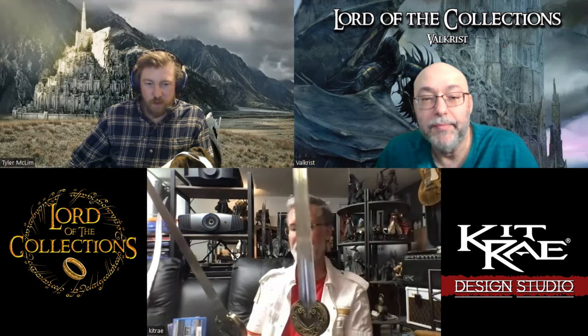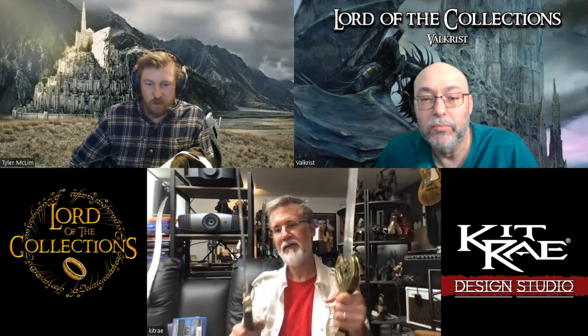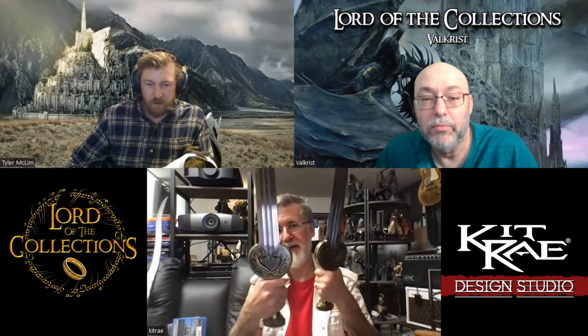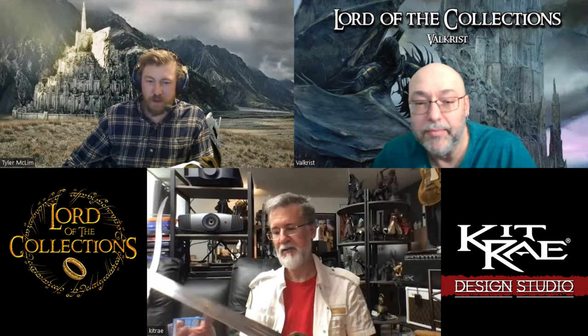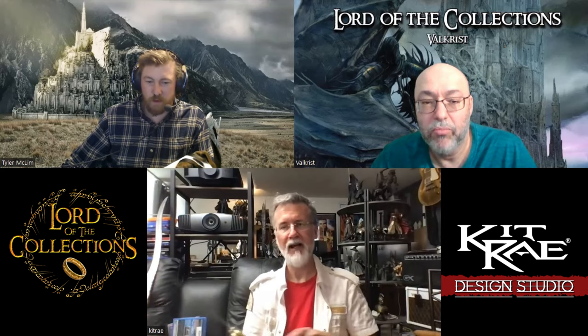What would you say the weight difference is between those two blades? I did a lot of work trying to get the weight down on this. You would think this would be heavier being real brass. This is heavier. This actually is nicely balanced. But stainless steel adds a lot of weight. It's more the thickness of the steel. I think on the final approved prototype, the fullers are deeper, and I think I went slightly thinner on the steel just to get the balance to feel better.